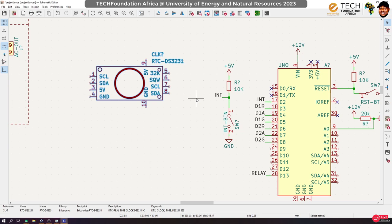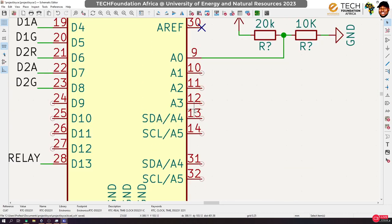They have to communicate, and Arduino is capable of three types of communications. We have what we call the I2C, or inter-integrated circuit communication, or two-wire communication. There is also SPI communication and UART. We will probably talk about the UART, but I don't think I would be touching on the SPI. But in my online video, I talk about it, so you can check it out. So to use the I2C, we need two lines. Yesterday, when I was talking about the analog pins, I said that some pins have dedicated functions. And for the analog pins, we have A4 and A5 serving as the I2C lines. If you want to communicate using the I2C communication protocol, these are the pins that you use. This is the serial data and serial clock.